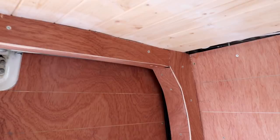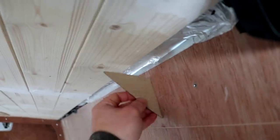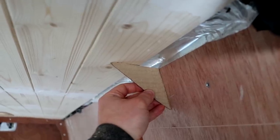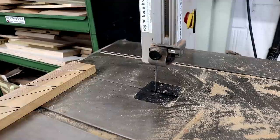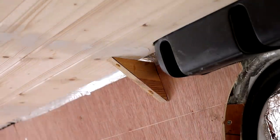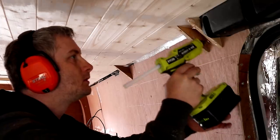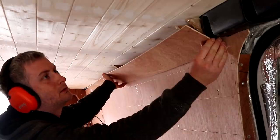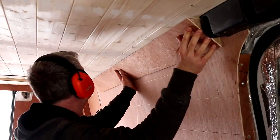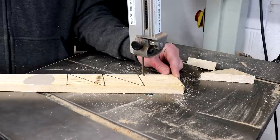We ended up with some gaps in the corners unfortunately, but rather than make new panels and waste more plywood, we decided we'd done our best and we'd caulk the rest. To close up the gaps in the corners of the ceiling, I cut a cardboard template of a skewed triangle shape to fit the contour of the corners, marked it up onto a piece of pine, and cut out lots of these at the bandsaw. Those got secured to the battens in the wall and ceiling with screws. I ripped some more plywood at the table saw, and hot glue was handy to temporarily hold pieces in place until we could get screws in. All these panels will be hidden later when we build cabinets in front of them.